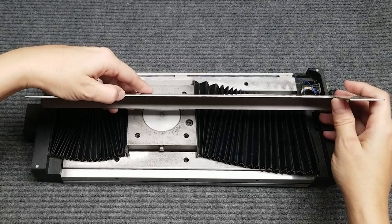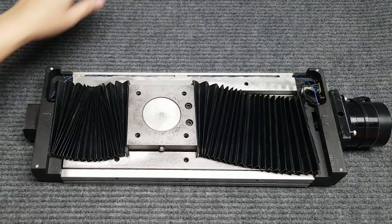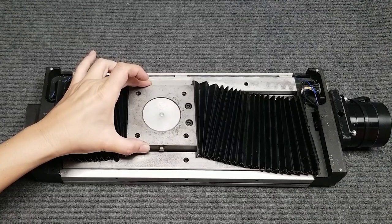With the covers off, we can see the actual axis part. This is tool steel, this is tool steel, this is tool steel - this seems to be wire EDM'd out. We have some bellows here in the way, so let's get these off. There's a little keeper here, oddly attached with flat screws. It's funny to see flat screws in something that's metric, and I believe these are German - this might actually be Leica. These screws are almost blued, not quite oxide.